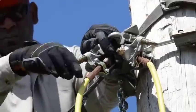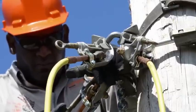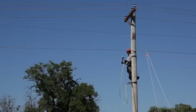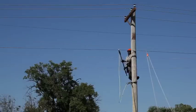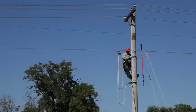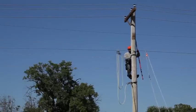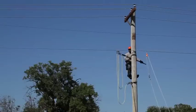Then another complete grounding cable set attaches to the cluster bar. With a grip-all clamp stick, he connects the other clamp of that set on the system neutral. Now he'll finish connecting the next set from where he had hung it on the neutral in the place he cleaned earlier by wire brushing.